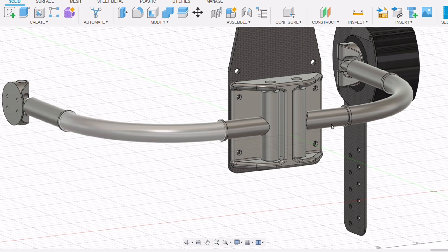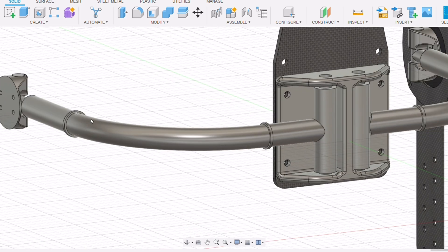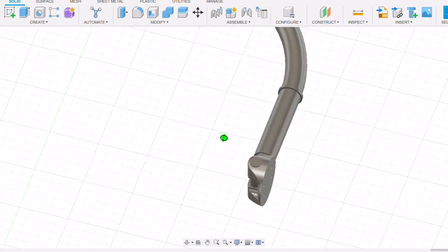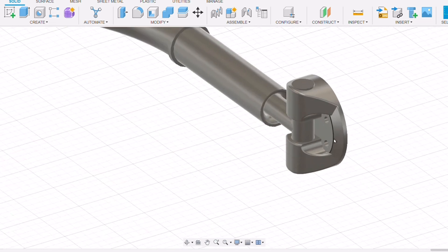The arms will be printed out of carbon fiber PLA, but I've made it so I can put carbon tubes over the end, make the T-piece brackets out of carbon tubes, and then wrap in carbon fiber once I know all of this is correct. That will also help ensure the joins in these arms will actually be strong enough for testing. The next part is both the actuator attachment point, a multi-directional pivot, as well as the actual attachment point for the legs.